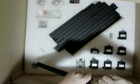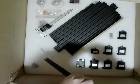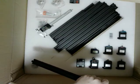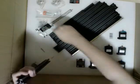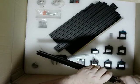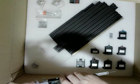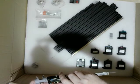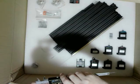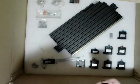How do I tell where the tapping stops? There. Let's do this again. I could see where. Yep, that's about where it's bound. So we can do it this way. There is 12.8 millimeters of screw exposed. There is a free screw. Everybody has a loose screw. Ducks are not immune. It is 24.9 millimeters long. And there was 12.8 millimeters free, 24.8 now. So that's 12.0 millimeters of thread on an M5 bolt.